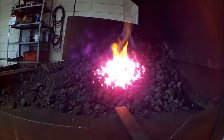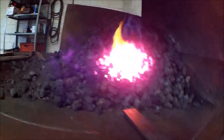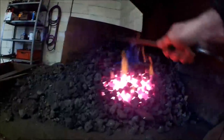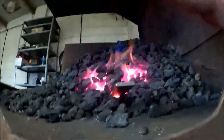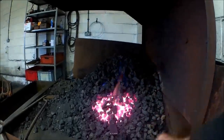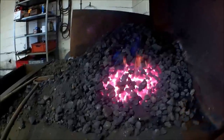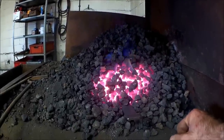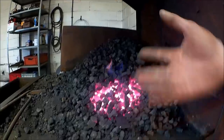One other thing — getting the right temperature for fire welding. I used to just watch the sparks; when the little fairies appeared you'd know it's up to temperature and you can fire weld. Another technique is when you've got your steel in the fire and you're wondering if you've got that lovely slippery heat: you can just lift the steel up slightly and see the core — you can actually watch the molten metal start to puddle, and you know it's right and it's not burning. Don't do this too often though, because as you lift it you're allowing heat out, allowing oxygen in, and moving it away from that nice temperature. But at the critical moment, if you're worried, just lift it, quick look, drop it down, and give it as much time as you think it needs.